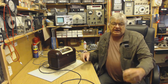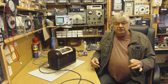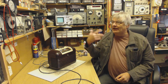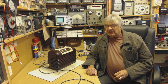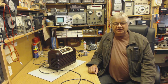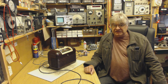And on the 100-watt amp, microphone 1, 2, 3, 1, 2, 3, the amplifier a few feet away with its metal plates in the ground, you could hear it. We were transmitting audio through the ground in the form of electrical waves, not sound waves. Had we done it properly, we might have got more than just a few feet, but I don't know, we read it somewhere, some magazine, some Practical Wireless or whatever, and we actually did it. So the ground will conduct all sorts of things, including interference.